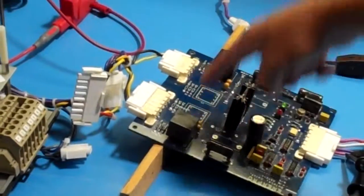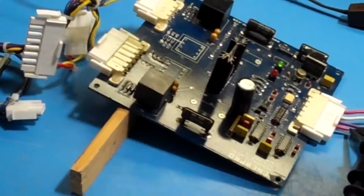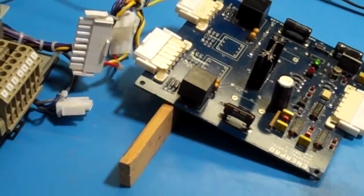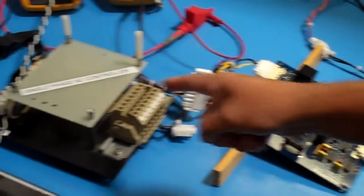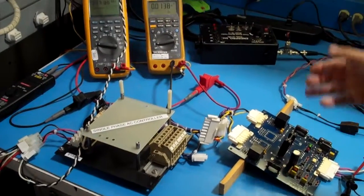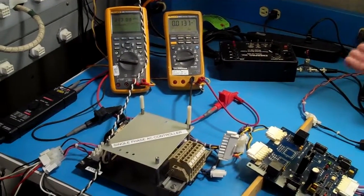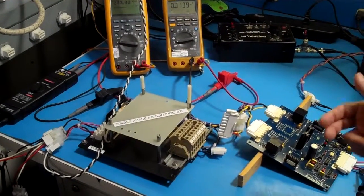CBTC-1 board. We have up to 4 outputs. We're only using 2 of them. This is really like 2 channels, but it's the same signal. Once we fire, we have DC firing going over the SCRs, and we're counting on one of the SCRs being reverse biased, as not the SCR that is firing. The SCR forward bias will fire and then the other one will take over.